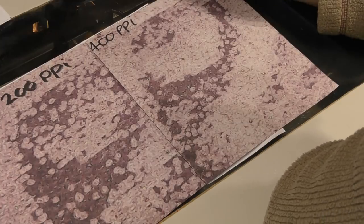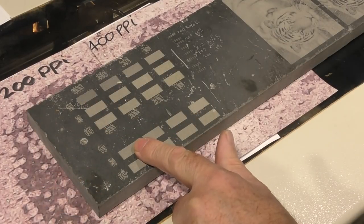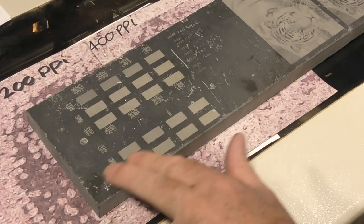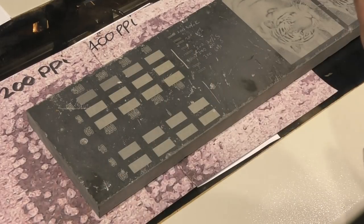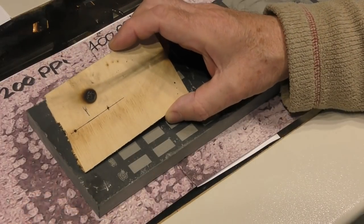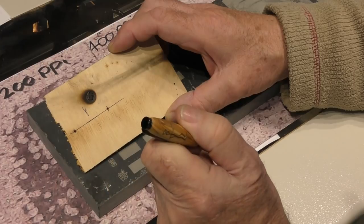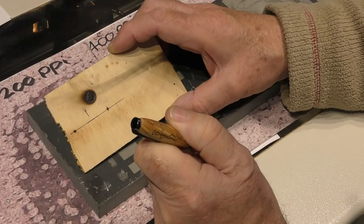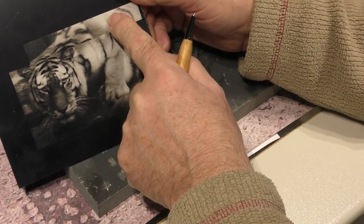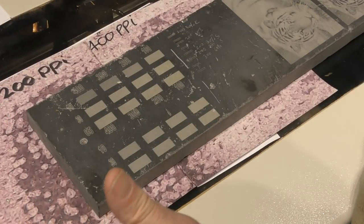We've got a much better tonal range in the 400 PPI picture, but something very important we mustn't forget: this is a binary material. No matter what the speed, no matter what the power - with the exception of very, very low power - we've got a virtually uniform tone for the grey. There is a binary tone to this material: it's either black or light grey, nothing in between. Whereas with a piece of wood we get black, dark brown, and light brown - that's not binary because we get different shades depending on how much burn we put in. With aluminium, the background is white, nothing in between, and no matter how many times you go over the same pixel it's always going to be white. There's no change in colour of these pixels because we overburn them.